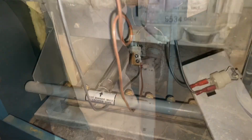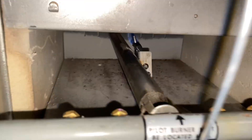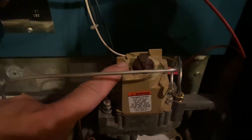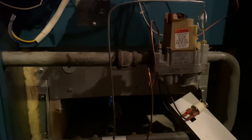All right, cleaned up pilot tubing and thermocouple — we have pilot. Hopefully that stays on. I couldn't get anything to even light before. Let's see what happens. Okay, pilot is lit — nice solid blue flame. Let's reinstall the burners.